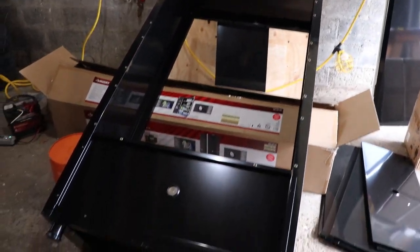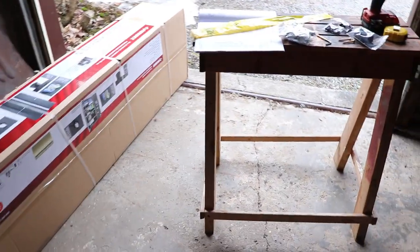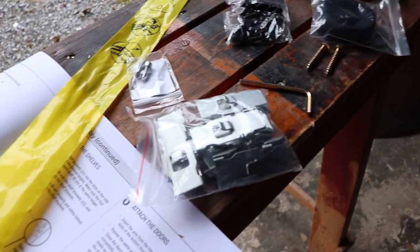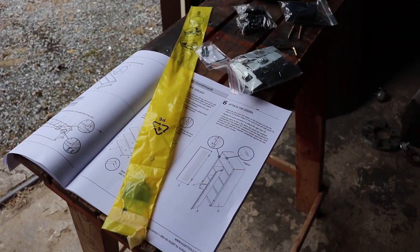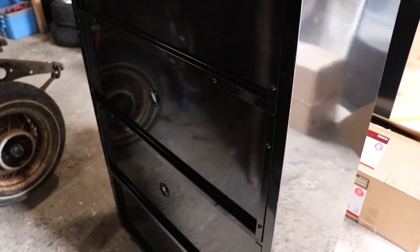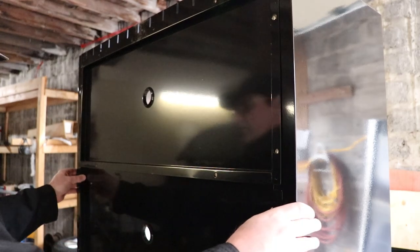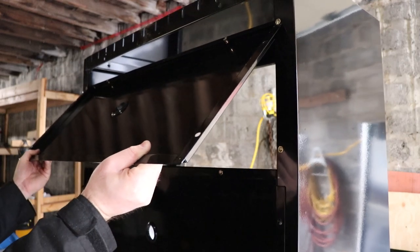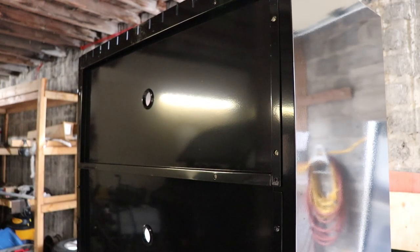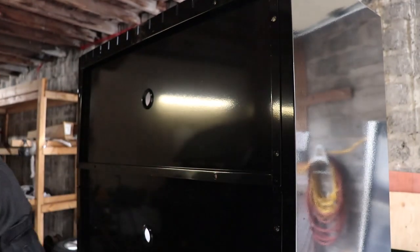I had to go through my garbage to find the keys — I didn't realize they're actually inside that plastic piece, not in a bag. So keep an eye out for that. They say to put the doors on last, so after this we put in the shelving and then put on the doors. Just going through putting all the back panels in — leave them loose so you can jiggle it around and square it. For the top panel, you have to slide it in then drop it into position. If you have a drill driver, put the screw on the tip of the driver — that's the fastest way of getting those screws started.